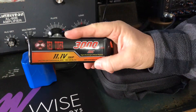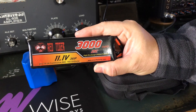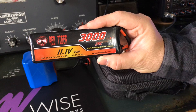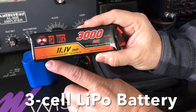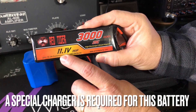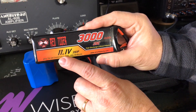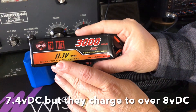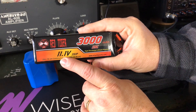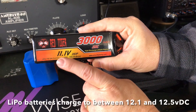Now, you'll see this other battery here. This is actually what I normally use. I purchased this years ago at an airsoft store called Airsoft Atlanta, and they just have it private labeled for them — they call it a Red Tiger. The specs are what's important: it's a 3,000 milliamp hour 25C LiPo lithium polymer battery. The label tells you it can deliver 75 amps continuous, 150 amp bursts. It's 11.1 volts, meaning it's made with three LiPo cells. It's not unlike our HTs — they'll say 7.2 volts, but really charge up to 8.2 or 8.3. Same with this: from a fresh charge it'll be about 12.1 to 12.5 volts, even though it says 11.1.